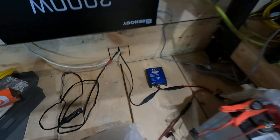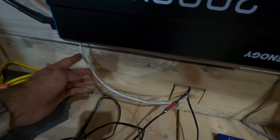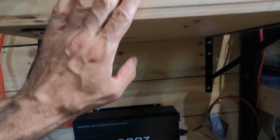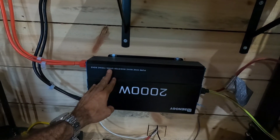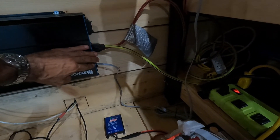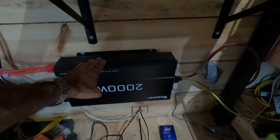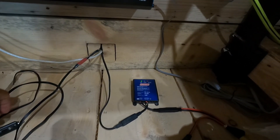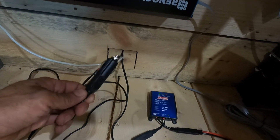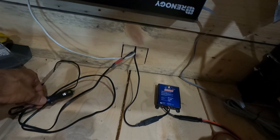Let's start at the very bottom. Down here is the grounding wire that came from the grounding spike outside. It comes to this 2,000-watt inverter, which converts 12 volts DC from the batteries up above into 110 volts AC alternating current, which is what powers these three sockets. We have a remote switch for that which allows me to remotely control the inverter without having to crouch down every time. I also have a 12-volt socket coming in from below, which lets me run any 12-volt accessory outside, such as my electric cooler.